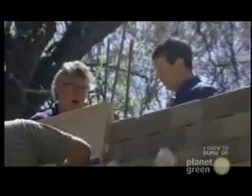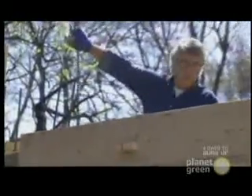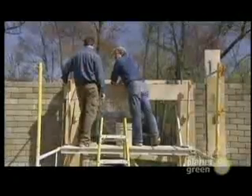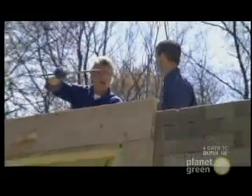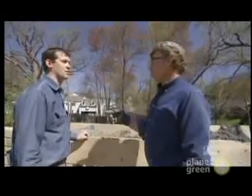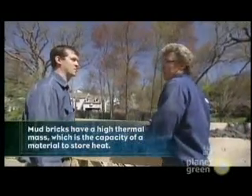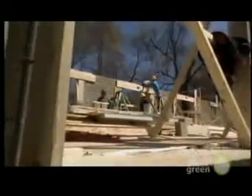This is a post-and-beam building. This is the post — it's going to be a concrete post reinforced with rebar. This is a beam, then another post, creating an arch that provides strength around the windows. On top of that, you pour a continuous bond beam around the whole building, which locks everything together. You've got the thermal properties of mud, the fact that it's cheap, and the strength of concrete. Cool way to build a building.